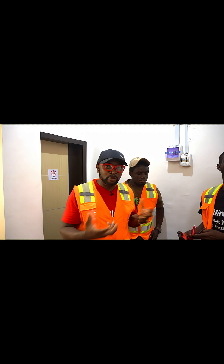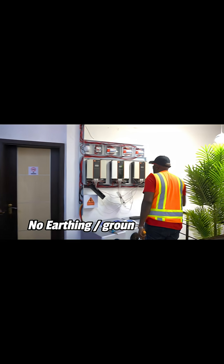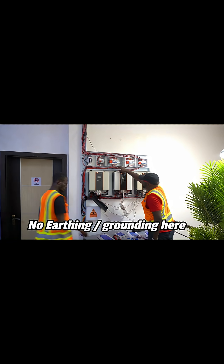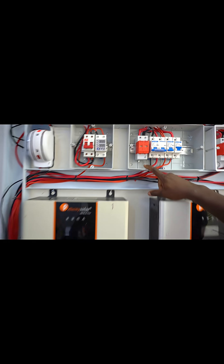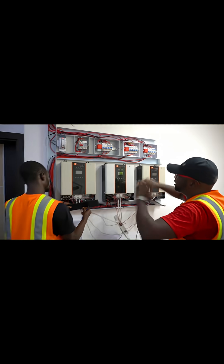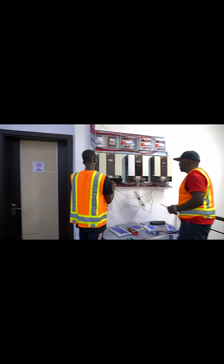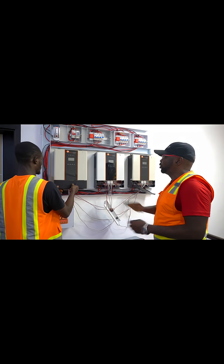So you'll be experiencing leakages in current — things like tingles of shock or even proper shocks. There is no earth connection here at all, which is very dangerous. The earth cable is supposed to come underneath these DC surge protectors, but there is no form of earth connection in this entire solar system. The batteries are just not connected.